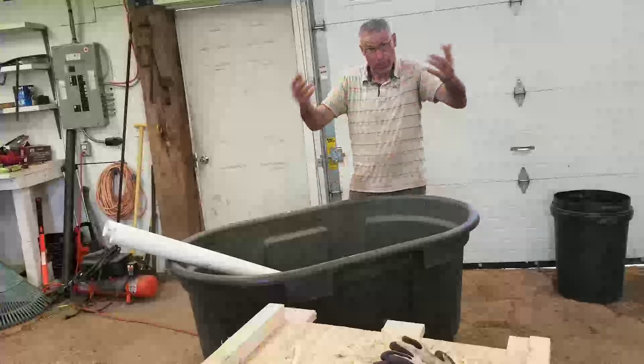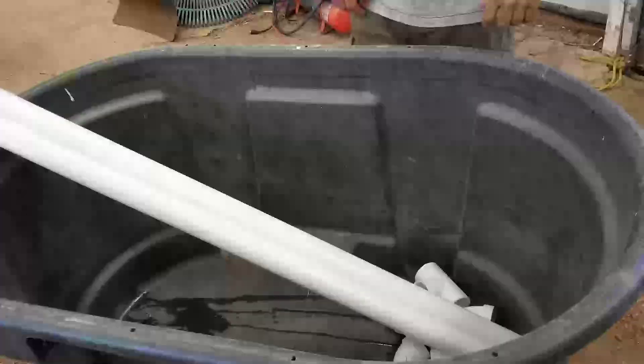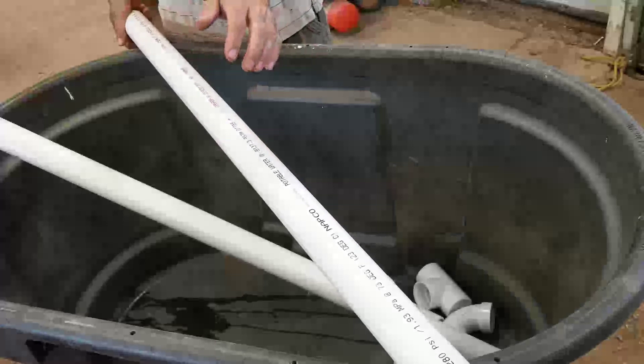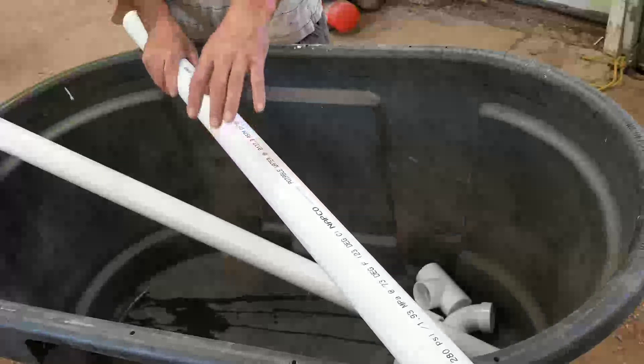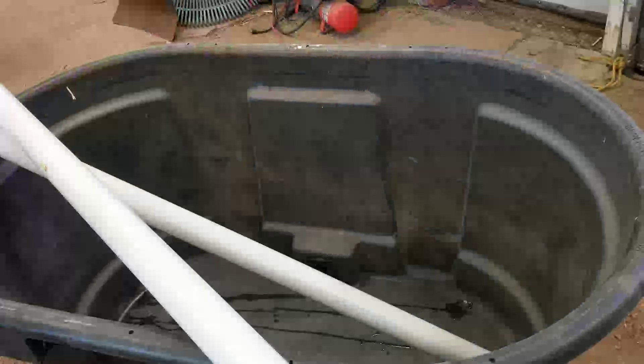My harvest time is coming fast, and at Liberty Way Farm when they're pulling out the vegetables we're going to have to wash them, so we're going to be making an agitator tub. We're going to be using two-inch pipe on this hundred-gallon tub. The pipe we're putting inside is schedule 40 — PVC is a better alternative than ABS because ABS is very porous and holds a lot of contaminants, so go with PVC.